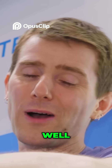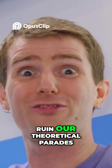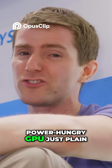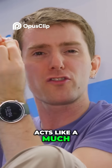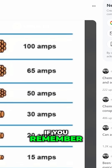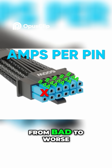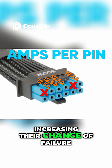So what causes it to overheat? As usual, it's that pesky real-world reality that always seems to show up and ruin our theoretical parades. Whether it's due to user error or manufacturing variance, sometimes the connection between your cable and your power-hungry GPU just plain isn't perfect. When this happens, the resulting poor connection acts like a much smaller gauge wire, dramatically increasing resistance in that spot, which reduces the current we can safely carry without overheating. Once one pin in a connector fails, the situation can go from bad to worse as the remaining ones try to pick up the slack — increasing their temperature, increasing their chance of failure, until finally...